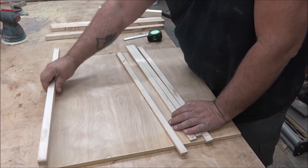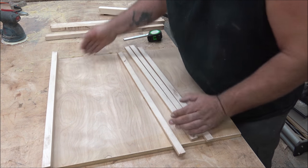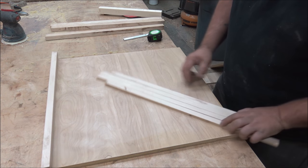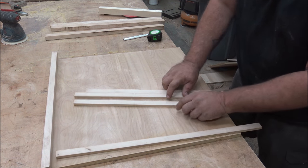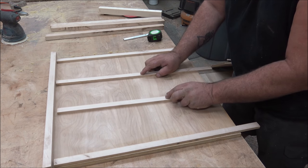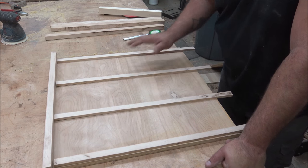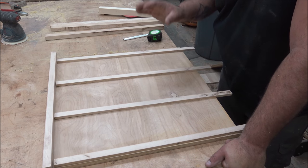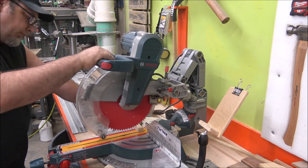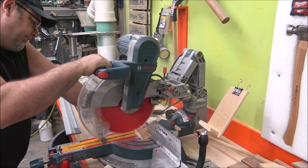The first thing I'm going to do is take my inch-and-an-eighth piece and cut it to size to match the width of my board, glue and screw it down at the end, then cut my four slats — one on each end and two roughly in the middle. The general rule of thumb is every 7 to 8 inches is a good spacing for the clamping board. I'm cutting every single length on the chop saw — both the front and back piece and all four slats — all at one time.